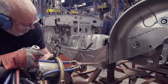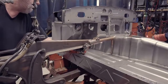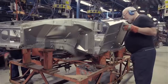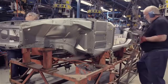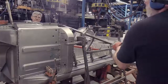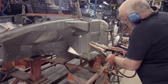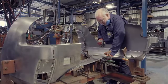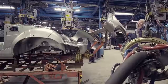The inner sill panels are followed by the floor. The outer sill and A-post assembly is placed into position and held rigidly by the outer jig frames, which ensure that the door apertures are true, fore and aft, and side to side. Last to be added to a roadster, while it's on the main jig, is the rear wings and decking assembly, which is constructed on its own jig before fitting into the main body shell.